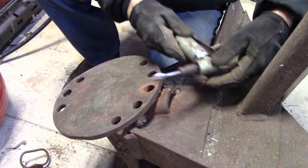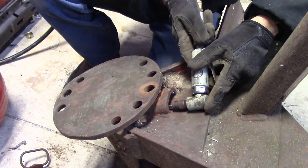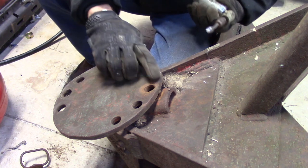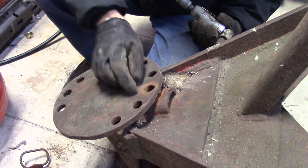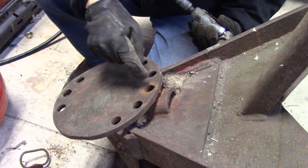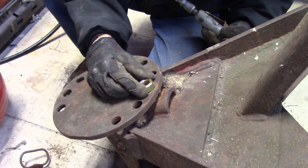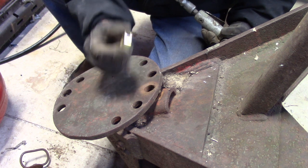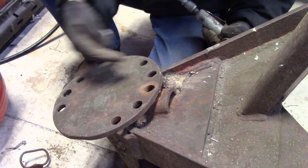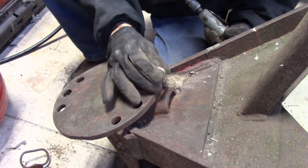The first thing I'm going to try: I'm going to take this angle grinder with this carbide burr on it, stick it down in here and try and clean up around the edge of the hole. You might be able to see a little bit on this top hole where the steel is kind of mushed up here from being beat back and forth, and it's the same way down inside. So what's happening is when I try and push the bushing in, it's hitting that raised portion. I don't want to try and beat the bushing in over top of it and end up getting it stuck, so I'm going to try and clean that up first and then see if this bushing will slide in.